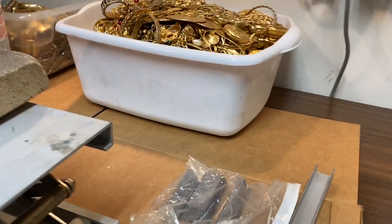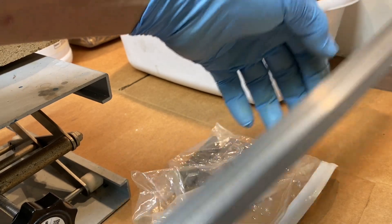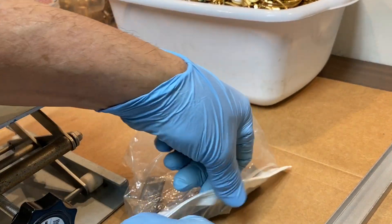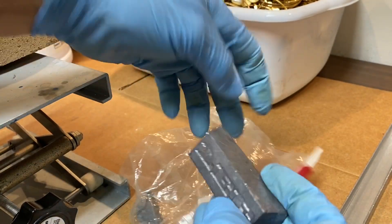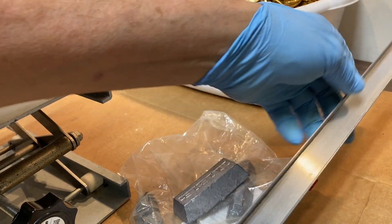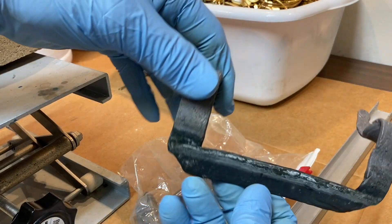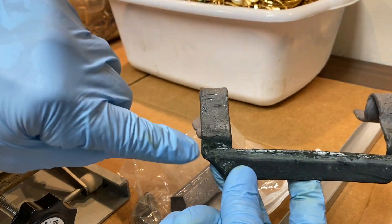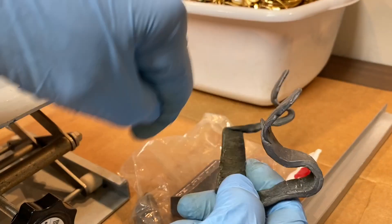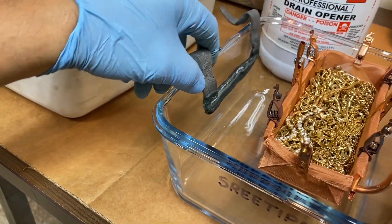Let's see what else. On this, this is a piece of channel stock that I bought — just aluminum channel. And I've got some lead that I bought on eBay, just hunks of lead, real cheap. I melted those in a milk dish and oiled the channel stock with a little bit of three-in-one oil. When the lead got molten, I just poured it into the channel and formed a long piece of lead out of it. Then I folded the corners and beat it real good with a hammer so it stayed in place, and fashioned the little hooks to fit on the edge of the dish.